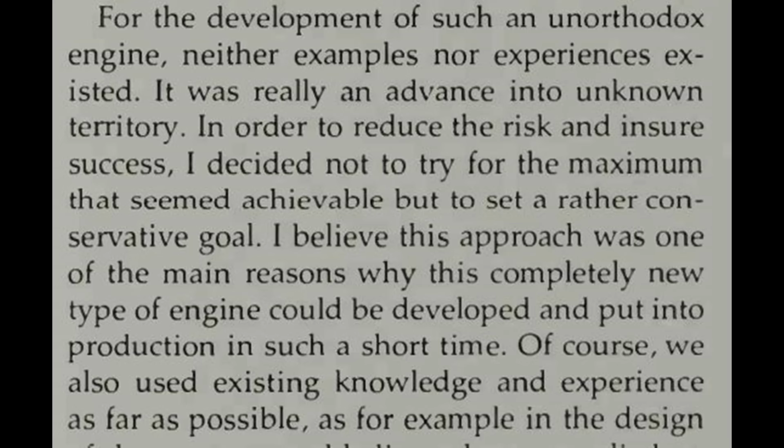There is one other combustion chamber design out there that I think you should know about. It's called cannular, and it's a hybrid of the two, and historically it's been very common, especially in the 60s. It uses individual combustors contained within an annular-like casing. These combustors are connected via holes or tubes so that each can doesn't need its own ignition source. In other words, it doesn't need its own glow plug or igniter, because the combustion fire can spread from one can to the next via the connections.